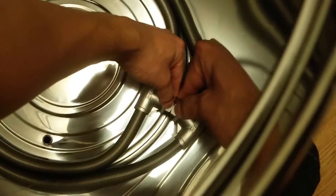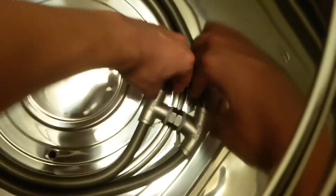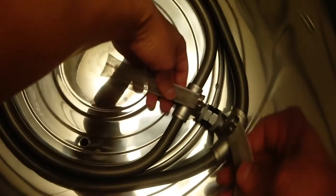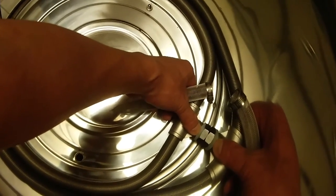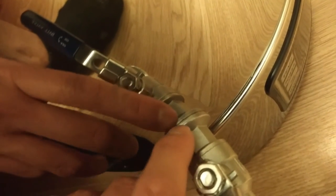There's the valve. Just unscrewed the nut from the inside — it took some finagling, but once you get the nut loose you just turn the valve onto here, and as some of you know there's just enough thread for it to fit. It does feel quite secure actually. As long as you put this washer on the inside, make sure it seals up nice. You don't have to screw it on too tight — just hand tight is fine. Make sure that valve is nice and tight up against the wall, because there is a washer that runs along the inner circumference of this piece. This piece has a recessed area for a washer, so just make sure that part is tight with the nut.